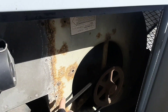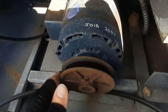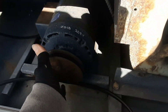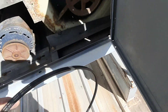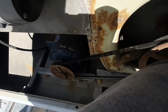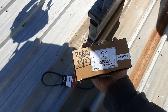I just want to get a better look at everything. You can see the belt looks aligned pretty well — it's just loose. And it's pretty worn. I don't have any play in the bearings, it's just the noise — I think we're going to be okay there. I'm wondering if this belt is the wrong size; it sits down in the pulley groove awfully far. There's the 4L500 — I don't think I've ever seen one this small. Maybe the 4L500 is normal, but I've never seen a 4L on one of these things. I made an executive decision — we're going to use an A48.